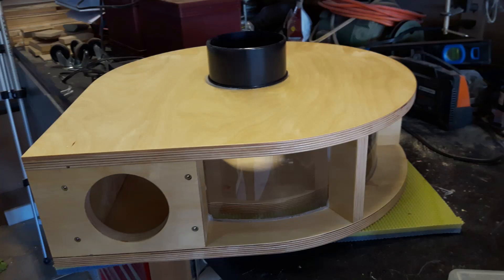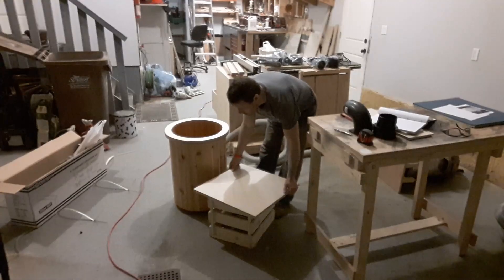Here's a close-up of what we're going to end up with. Our inlet is sized for a 4-inch pipe and the top connection that goes into the motor is going to be a 5-inch. The outside diameter is roughly 20 inches, which is based on the size of the rim of the bucket itself, which we'll use to base it off of.